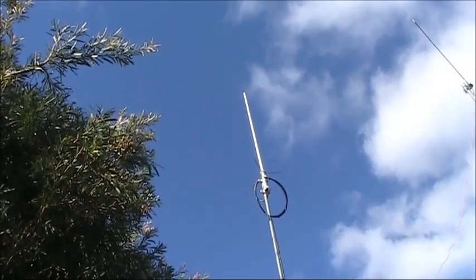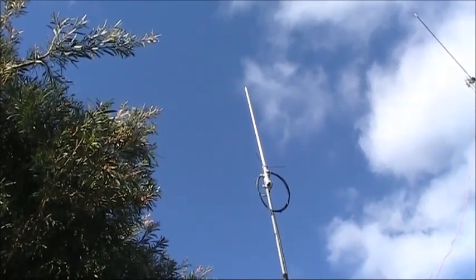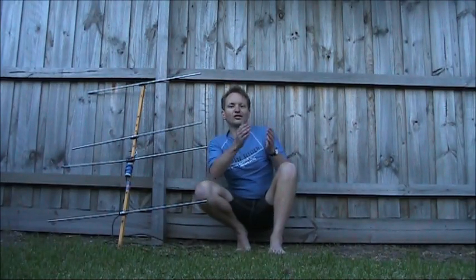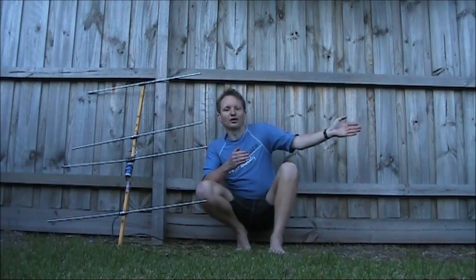For simplex communication with other people that are not very high, you might get a 10 to 30km range. A vertical collinear antenna gives good omnidirectional coverage of FM, and it's good if you live in an urbanised area with lots of repeaters and amateur operators close by. If you're in the country, or all the people you want to talk to are in a particular direction, then a beam antenna might be better.